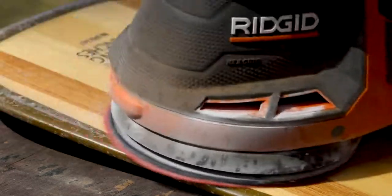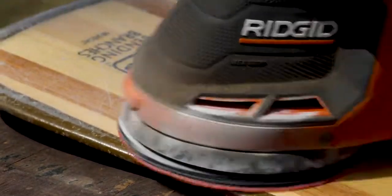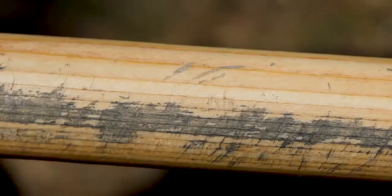So I'm just going to sand it down here — it's pretty self-explanatory. Get everything roughed up. You can use a rougher sandpaper if you have deeper gouges. The key is to get something for the urethane to adhere to, so you have to sand. You can't just throw it on top or it's going to come right off. Here I'm working on the shaft on that worn-out spot.